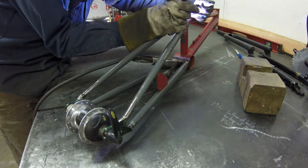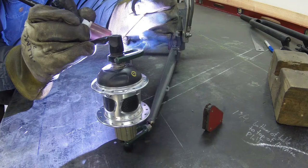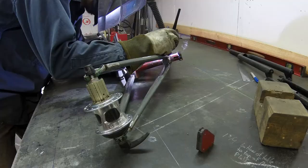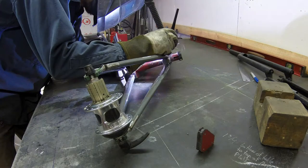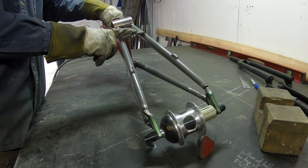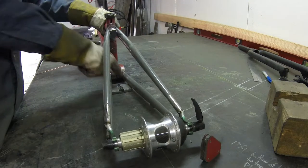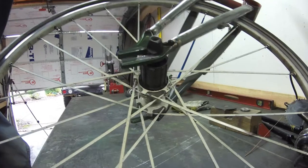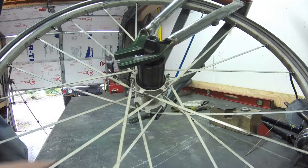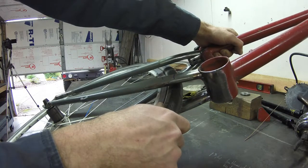Now because everything is pretty well aligned and locked into place, leaving the rear hub in to make sure nothing moves around, I'm going to go ahead and weld the dropouts in place and get most of the rest of the seams stitched up. Now time to get this bridge cut out — we'll throw in a couple of extra supports, top and bottom, just to help stiffen up the frame. Just want to check tire clearance, so I'm throwing the back wheel in and putting it all the way forward in the dropouts. Plenty of space on either side and plenty of space top to bottom.